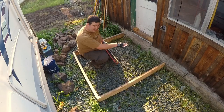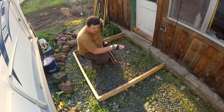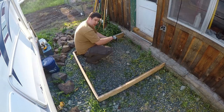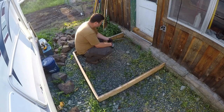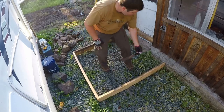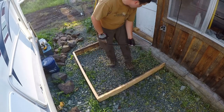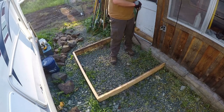One thing I want to make sure is that I have slope away, so I'm going to use this kind of as the rough guide, but I want to make sure we're sloping away, which we are, which is good. Oh yeah, and we want to roughly square it to the building too. Pretty square-ish. I mean, it's hard to tell obviously with that.